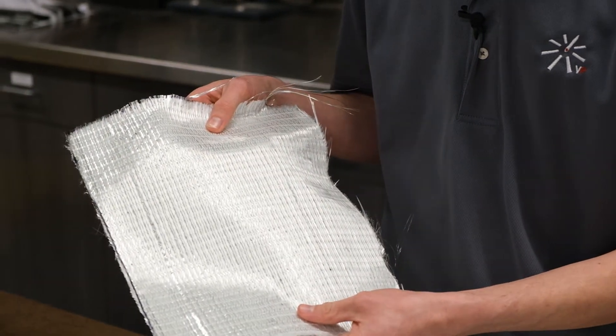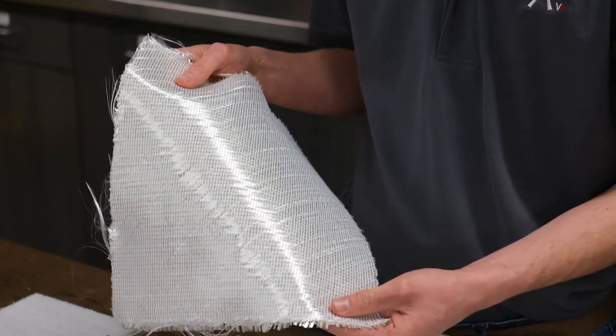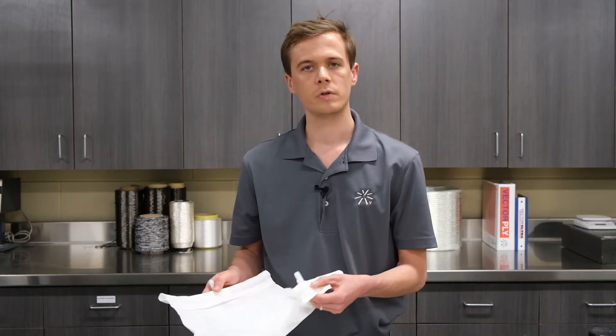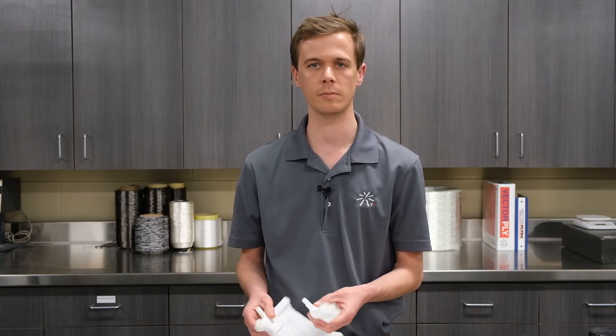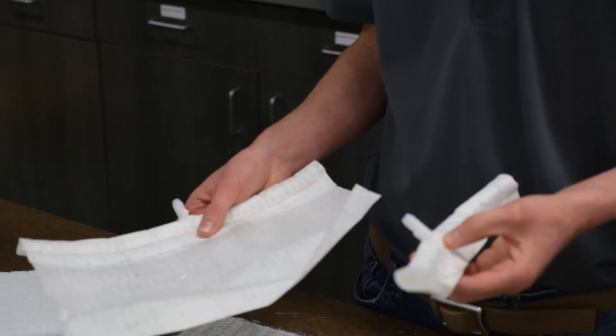On our fabric side, we're going to use our EQX 2600 Quad. This is a balanced e-glass fabric, and you can see that it does not have any chopped mat on the back side, which would add a little bit of weight, a little bit of thickness, and slow down the resin flow a bit. We're going to infuse that around a piece of PET core. You can see this is actually an infusion cut core — it has both grooves and perforations. Those grooves are going to flow our resin when we hit this core, and those perforations are going to let the resin go down to our bottom layer. For our feed and vacuum lines, we're going to use a piece of our pre-made consumable material. This green is our feed line, the red is our vacuum line. This is just a piece of spiral wrap with peel ply stitched around it. It's something some people make in-house, but it can take time and labor. This is a nice time savings and can also help save resin and money.